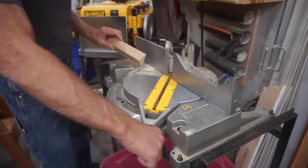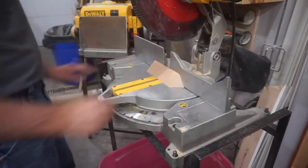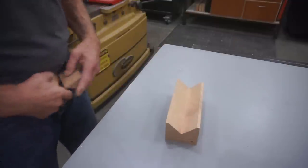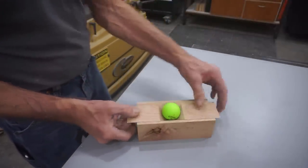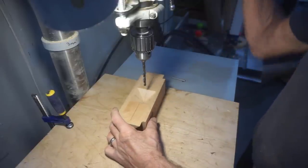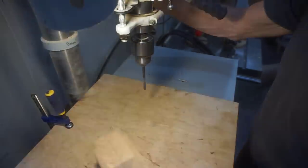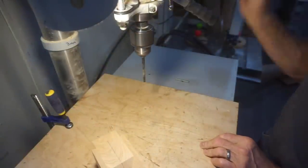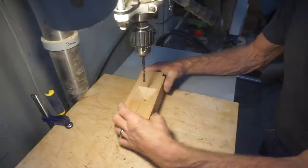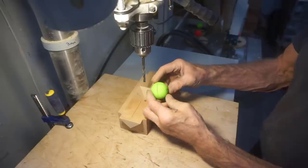To prevent kickback of the loose V piece on the final pass, I switched to a custom push stick modified with an extra long heel to push the V scrap all the way past the blade. With the flat face of the V scrap against the fence of the miter saw, I cut both ends at a 45 degree angle and then cut it approximately in half. I trim off both ends of the V block — you can see how well a double V block fixture holds a dimpled sphere in place for drilling. I glued the V scraps into the V block with Starbond CA glue, drew center lines in both directions, then with a quarter inch bit in the drill press, drilled down through the very center of the double V into the sacrificial table. Putting a short piece of quarter inch all-thread into the hole in the table and placing the fixture on top aligns it and holds it in place for repetitively drilling accurately through the center of a Callaway super soft golf ball. Easy peasy.